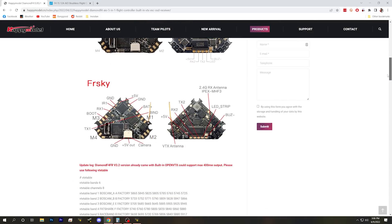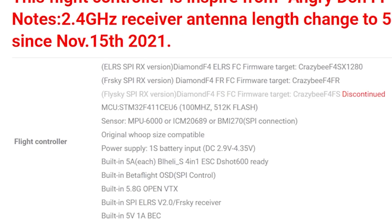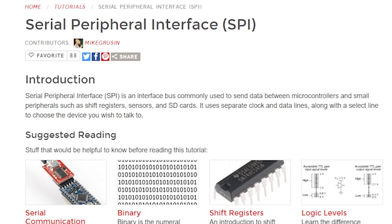The Mobula's flight controller has what we call an SPI-based receiver. If we scroll down, we can see ELRS SPI-RX version. The BetaFPV F4 flight controller also moved to SPI in version 2.0. SPI stands for Serial Peripheral Interface — it is a high-speed way for manufacturers to connect peripheral devices to their microprocessor. The gyro on your flight controller is connected to the processor via SPI. One advantage of using SPI for the ExpressLRS receiver is lower latency. Because the SPI interface runs at a higher speed, you cut a tiny amount — just a few milliseconds — of latency off.